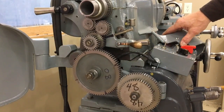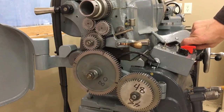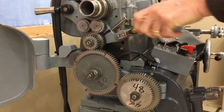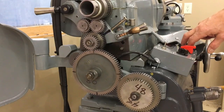This is the drivetrain. You can see it moves power from the spindle through the reversing lever, through this big 80-tooth idler gear, to the power shaft of the gearbox through the screw gear.